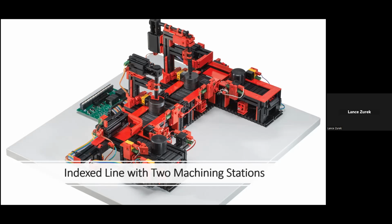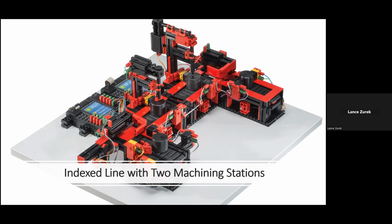Again, it's available in both the 24-volt version with a 26-pin connector and a 2.54 millimeter grid for use with PLCs, and also a 9-volt version wired to the pre-programmed robotics TXT controllers, in this case, 2 robotics TXT controllers, and so you're going to need 2 power adapters for this one.